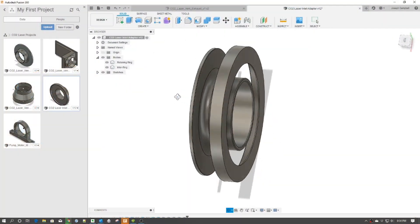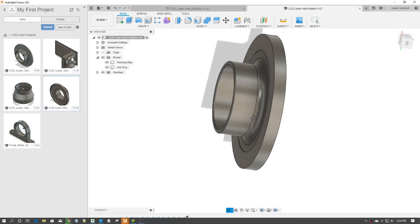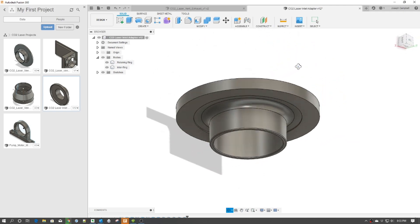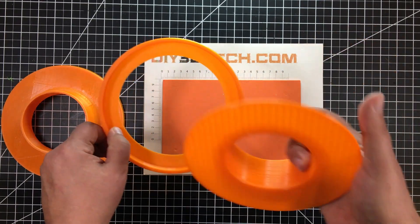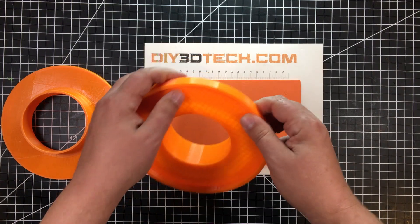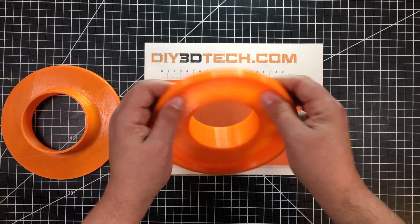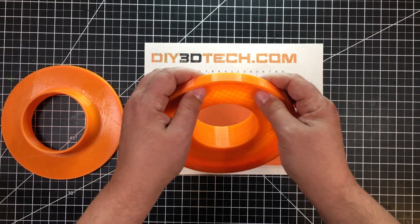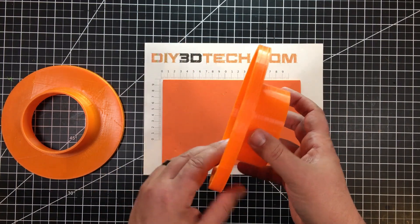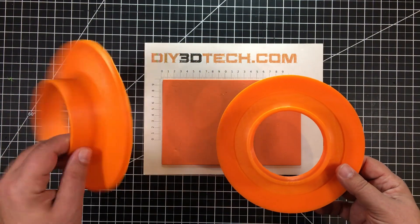Here's a little bit of the magic. I designed these in Fusion 360 — you can probably use whatever design program you want. Fusion 360 worked nicely because I could actually see how the parts fit together. Basically, this piece fits inside the retaining ring, and as you can hear, it's actually a snap fit. This provides a tight seal, locks it in, and then this simply snaps on the blower motor. Works perfect — a lot less headache than printing it as a single part.